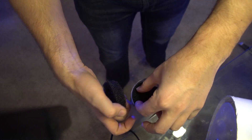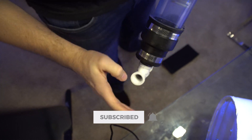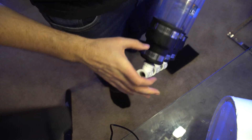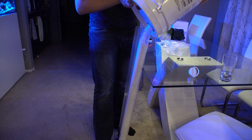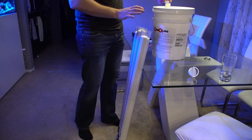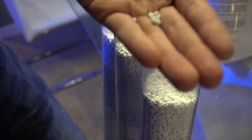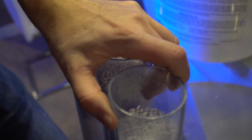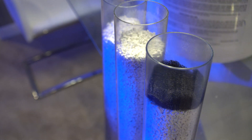Now we're going to get this reactor built and get it up into the attic. We've got our circles cut — let's get them pushed down into the tubes. Foam stoppers are all the way in, nothing's poking down into the pipe, looking good. Now we can add our media. It looks like I used about a third of the container to fill all three tubes. The granules are slightly irregular, like a pellet, which is supposed to prevent channeling inside and make it more efficient. We put a chunk of foam on top to seal things in.